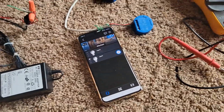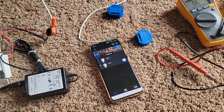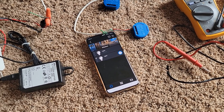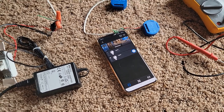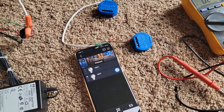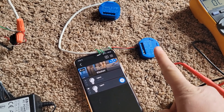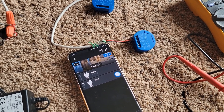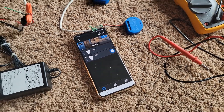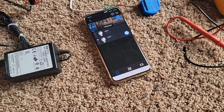So that's my basic experience with the Shelly One so far. I'll probably do a follow-up video to let you guys know how they've worked for me. It seems pretty good other than trying to connect to the thing — that was such a pain. Like I mentioned, I had to search for the Shelly device by IP address and go into my router to find that IP information. Thanks for watching, any questions or comments please hit me up below and have a good one.